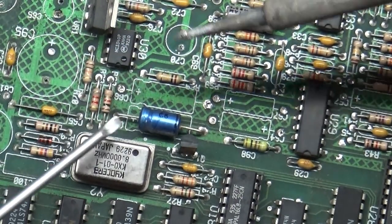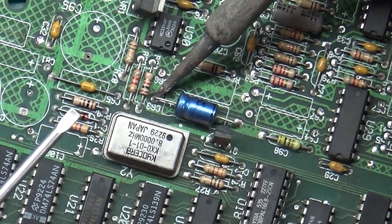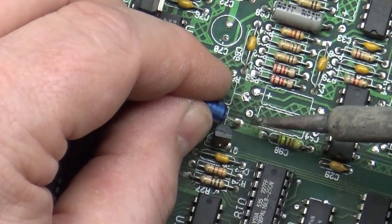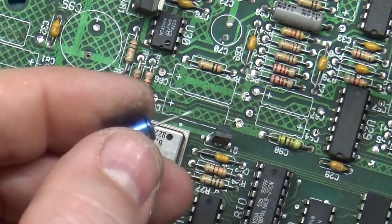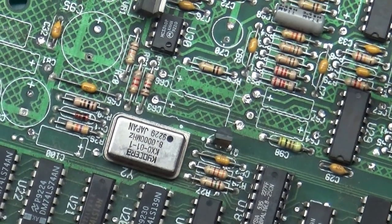Okay. So again, you heat up one side till it liquefies, and then you just bloop. It comes right out. It's that easy. Heat up the other side, and then bloop. Comes right out. That's the easiest way to avoid damaging these vias and the traces and all that stuff, because